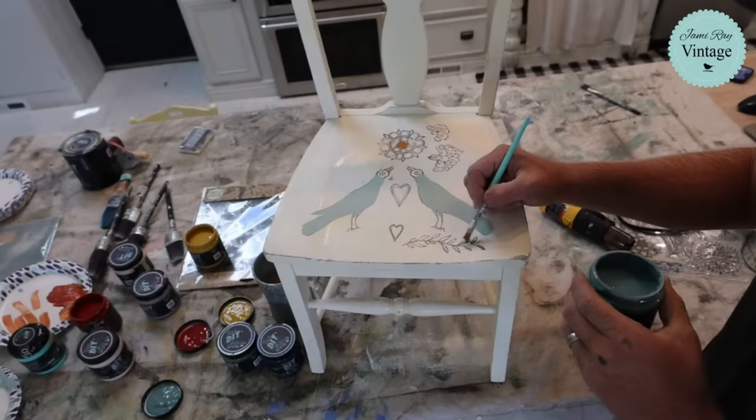The other thing that's different with the three paints is the DIY paint and the milk paint. When you sand them, they powder because they're very porous, almost super dry paints because there's no sealer in it. Whereas the Cottage Color, you've got to be careful when you distress it because it's not going to powder because it has that built-in sealer. I feel like it gets powdery. Yeah. It's still a mineral-based paint. It powders, but not the same.